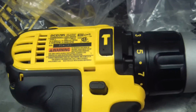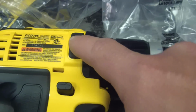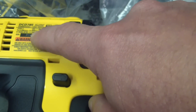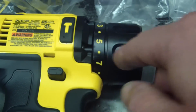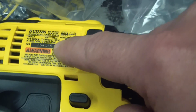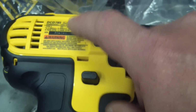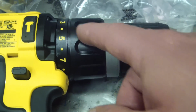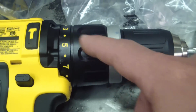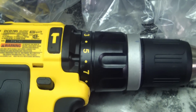And you see here, 34,000 beats per minute. All that is those sawtooth little cuts on the back of here. So if we go 34,000 divided by 2,000 RPM, that means there's 17 teeth on there. So, the classic maneuver, right? The higher the number, the better it is? No. If that number were lower, it would hit harder, because they could fit bigger ramps in there. So if they had 5 on there, then it might actually do some effective drilling, but they don't.